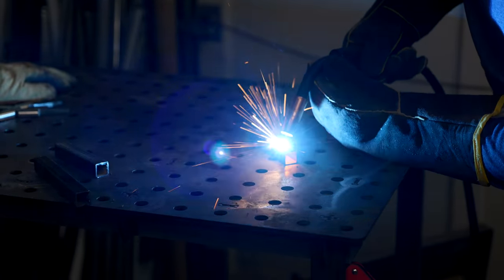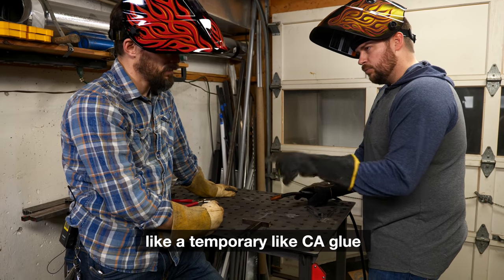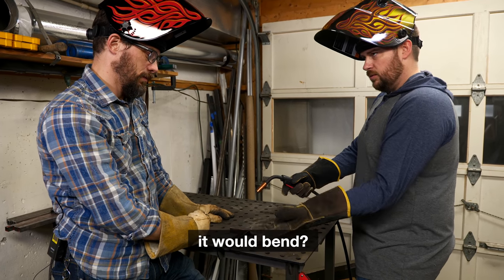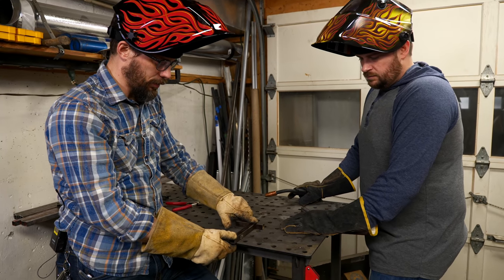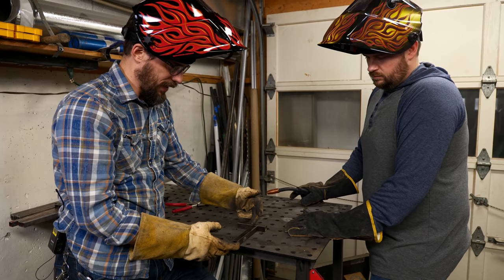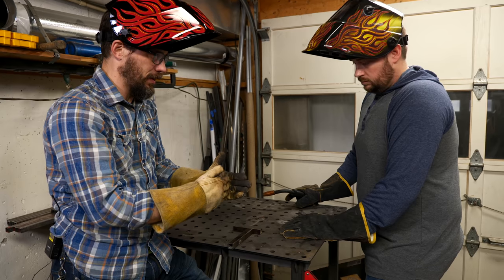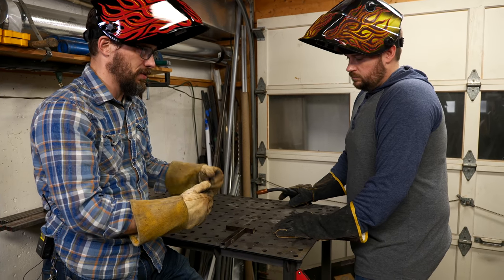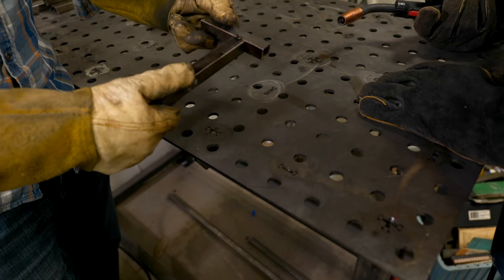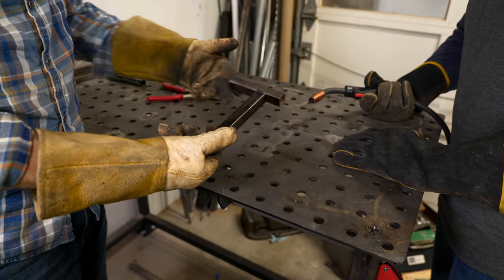Yeah, there you go. Tack welding is doing a small spot — like a temporary CA glue — before you do all of it. Because if you were to weld this one part, it would warp — if you put a whole bunch of heat on one part of this joint, it's going to lift like this. So you put a tack here, then a tack on the inside, and then on that side, and it locks everything relationally together. Then you go back and fill in those welds so it's strong. Then you would want to flip over and put one there so you don't run the risk of it folding in either direction.